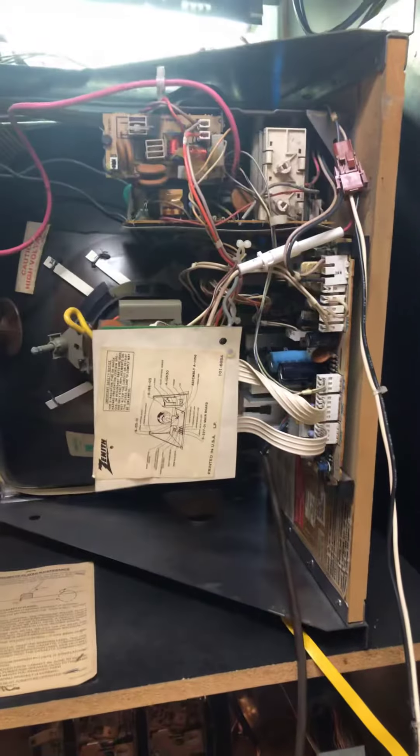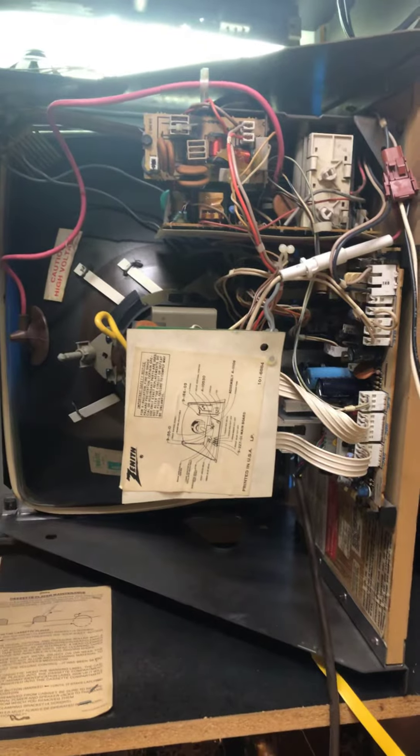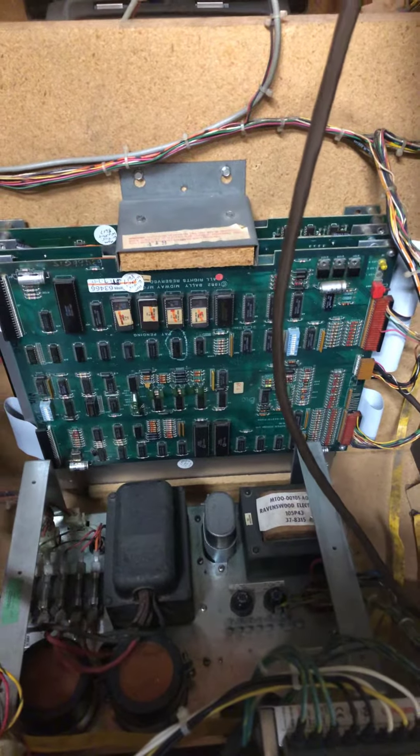It's connector E. That one's D — that's where sync plugs into. But right next to E is X. X has got some voltage on it: X has plus 26, plus 12, and ground. And then plus 26 and plus 12 happen to coincide with horizontal and vertical sync on that.